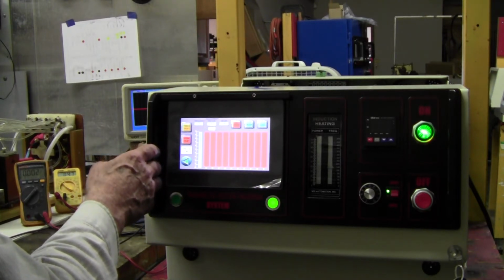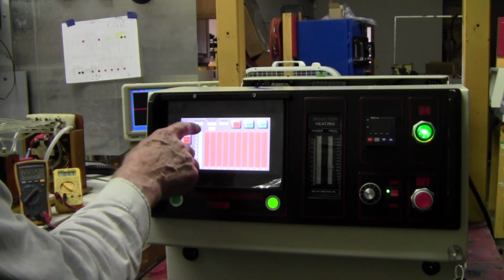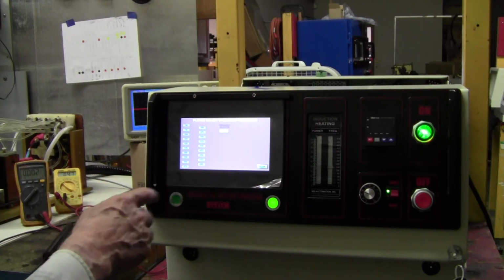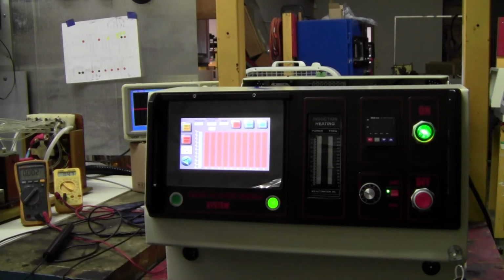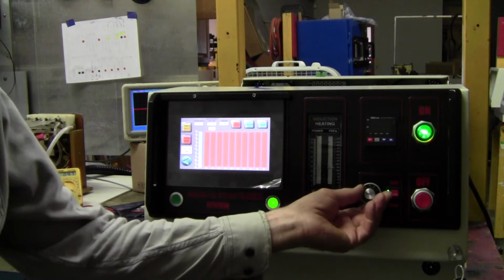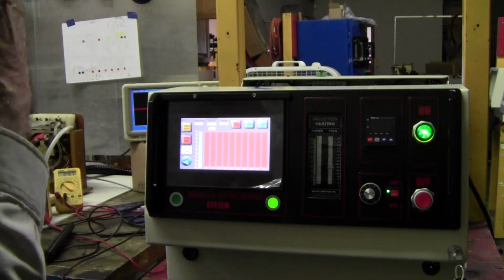And here's another thing. Now you have to remember to change your frequency when you're measuring inductance. So if you know what the frequency is, then you just enter it in. In the case of the 100 millimeter coil, it runs at 180 kilohertz, so the closest number was 175, so that's what I put in there. So anyway, I turn this knob down to close to what I think is 85 volts, and then we'll leave it there after we do a test.